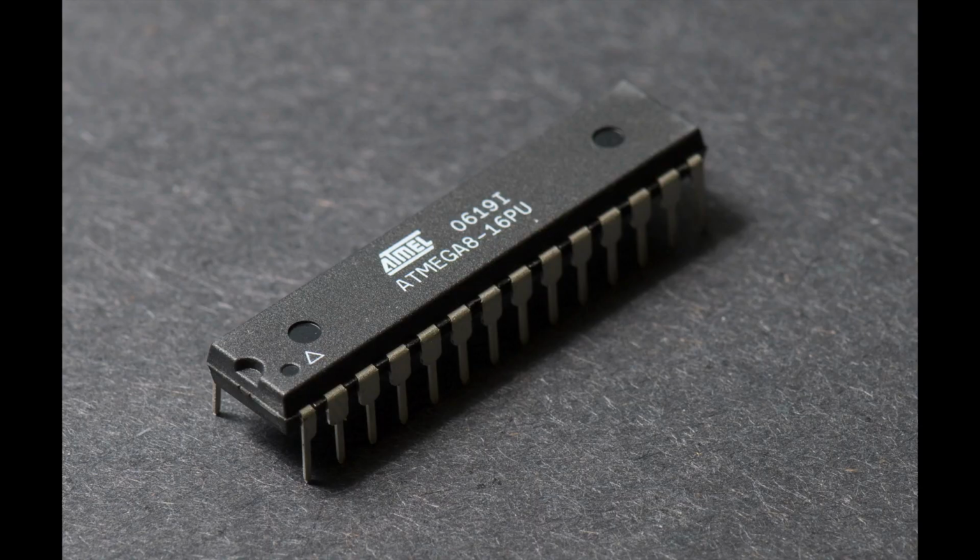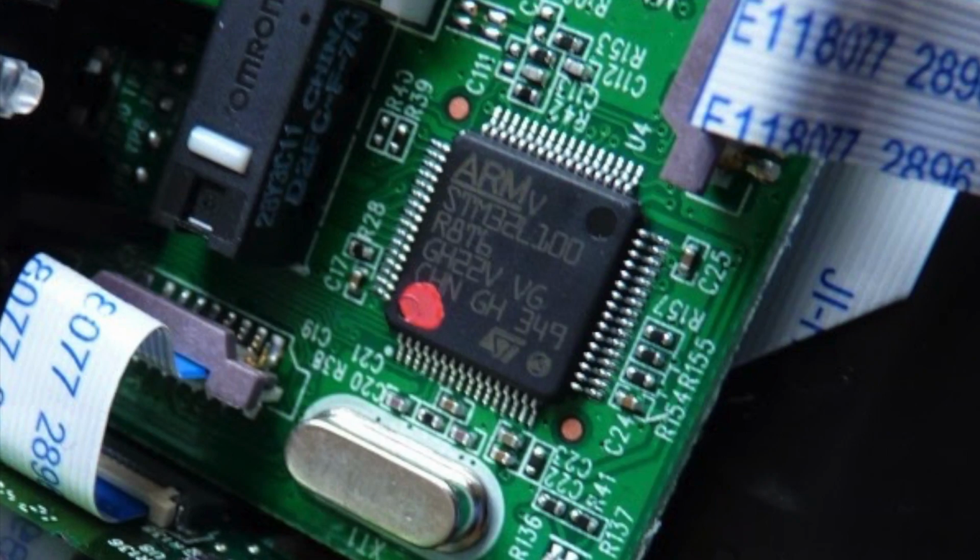There's also the additional issue, which isn't as big a deal, but these older 8-bit chips worked off of a much slower clock speed, usually around 16 megahertz or something like that, whereas the faster 32-bit chips like these may be 5, 10, 20, 50 times faster than that, and the rate that you can send a signal to that and have it processed is much faster on those than it would have been in an old chip, so you have a little bit of extra buffer from just the overhead of the operations and the rate at which the chip can poll its interrupt if you're using an ISR for your debounce routine, which means you're additionally sending more windows for the possibility of picking up switch bounce or chatter.